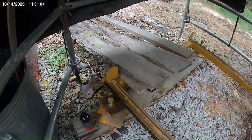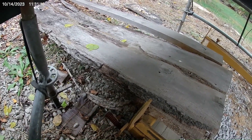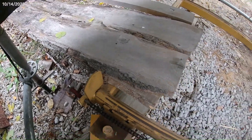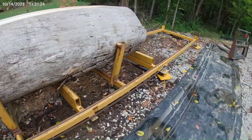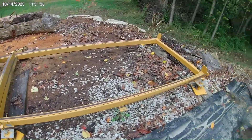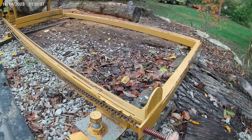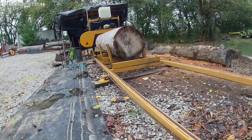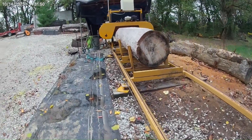So if you come down here on this end, I'll show you. I've got a spring on the end of it with a wing nut and a tensioner that I built so that it always has a little bit of slack in it — it keeps the chain taut but yet it will try to pull itself. The chain goes all the way down to the other end, laying on top of my table adjustments so that it doesn't lay in the dirt. I've got the same thing on this end so you can tighten up that tension on the chain a little bit. As it propels itself down the track, it just pulls itself on that chain and it's cushioned as it goes.